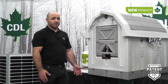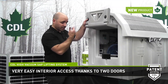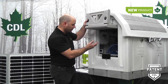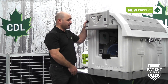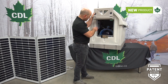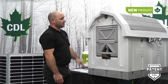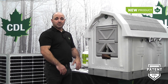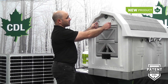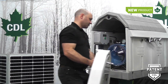To access what's inside, it's very easy. There's a first panel at the front to have visual access to the inside. When people are in the forest chasing leaks or wanting to do a quick checkup, they can easily access the tank and the vacuum gauge on top of the tank here. To quickly remove the front wall and access all the interior components of the sap lifter, all you have to do is use the two levers or handles here and completely remove the front wall.